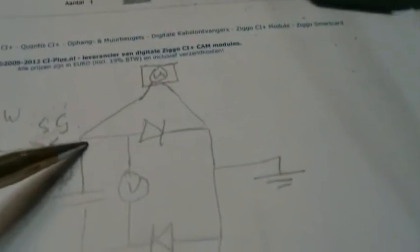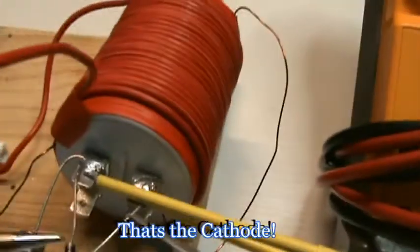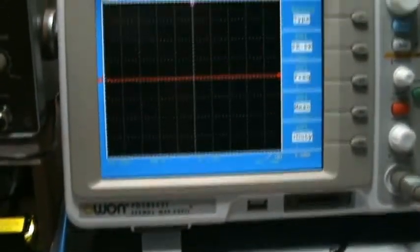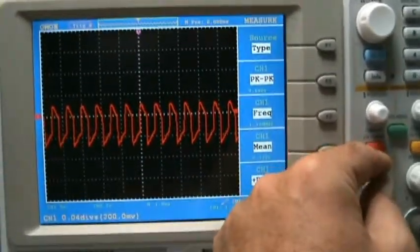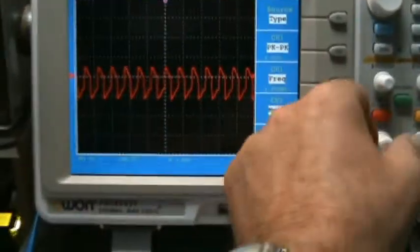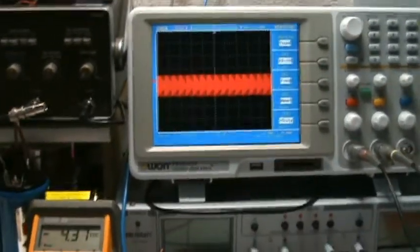And let me check where the AV plug diode is. It should be the other way around, I'm sure. You can see the plus is on the diode with the anode here. So my drawing is again wrong here. Okay, but I will now fire up the catcher again and see that we have the same waveform on the other side of the cap, until it fires and then it goes back. And we have this 10 volt 1.3 megahertz wave. Okay, thank you for watching.